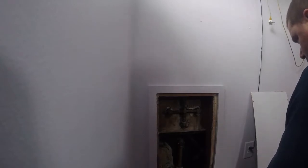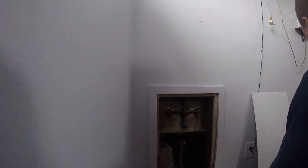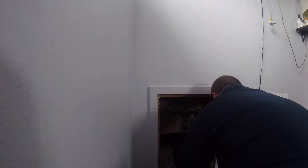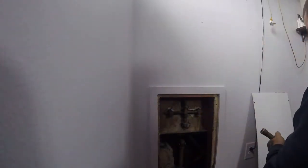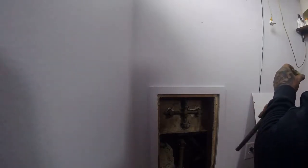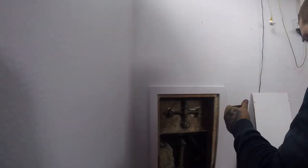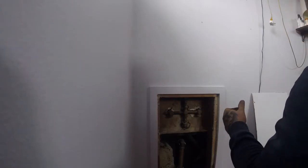So like those two, you call them the feeds, they bring the water up there, right? Yeah. So for sure, we replace those. One of the advantages of replacing them, besides that old galvanized hole, is that you might get a little more pressure when you put in the copper or the PEX. Yeah, we're doing copper. Generally, that's the thought. You should get better pressure, but remember, you do have a lot of pieces still downstairs that are kind of just put together.